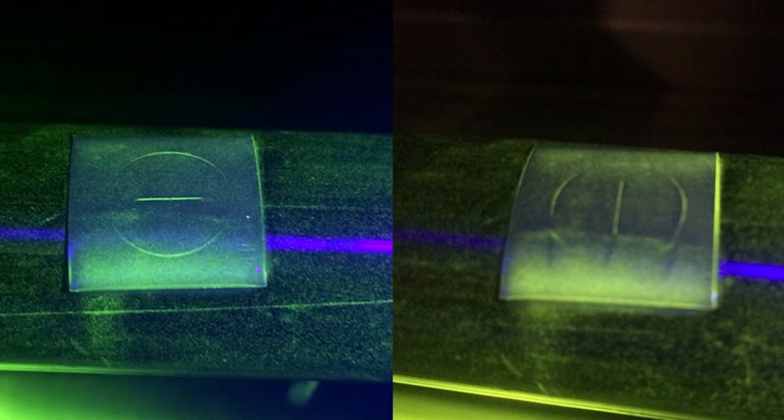So multi-directional technology allows you to fire multiple mag shots that do not interfere with each other because they're out of phase. So you press the button once and it fires the mag shot in both directions, and they're out of phase with each other, so it does not cancel the other magnetic field out. It takes some balancing of the magnetic field strength due to the part geometry, but ultimately leads to inspection in about half the time.